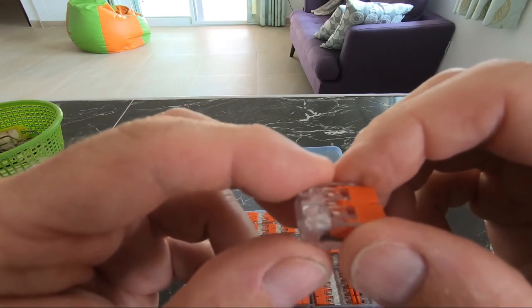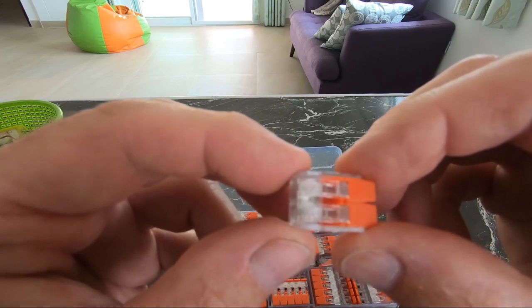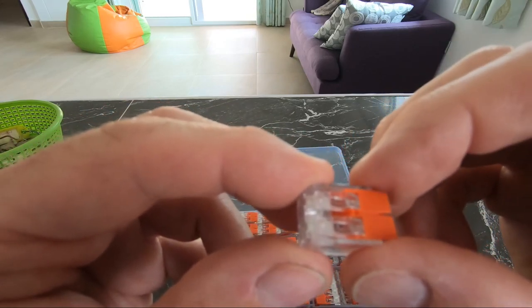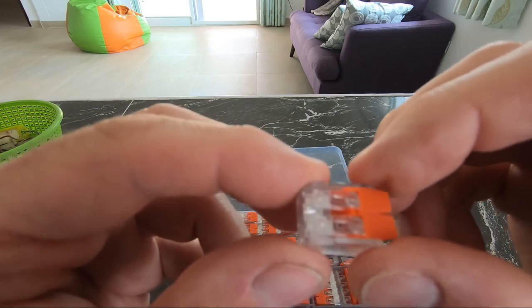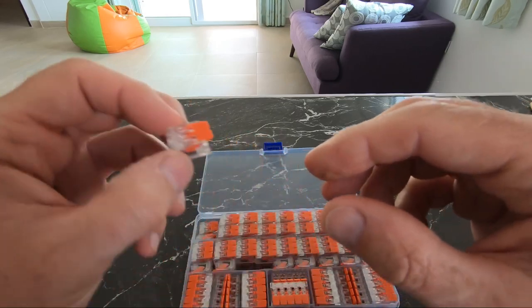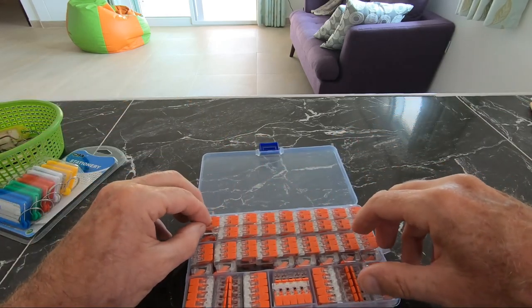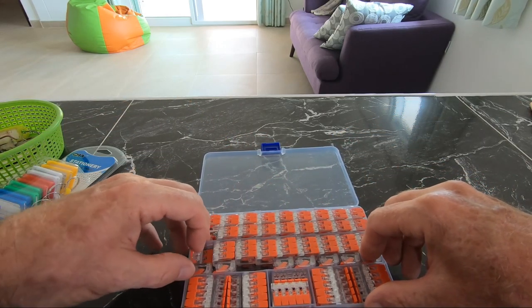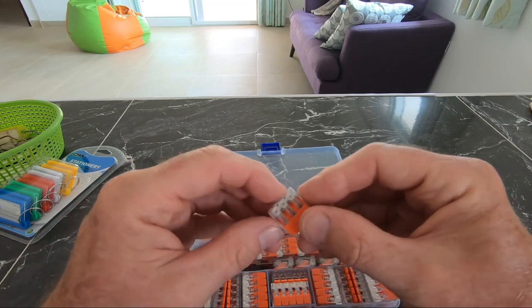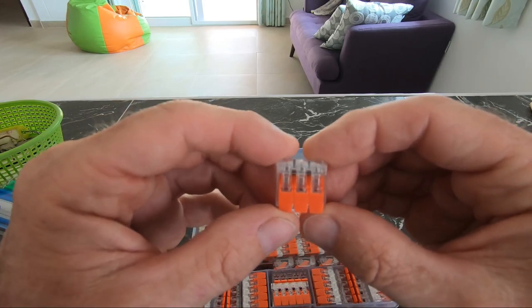And it's not going to unravel like the insulating tape that they often use here. That's what worries me about any connections anywhere here which are joined by insulating tape, is that one day the tape will dry out and the bare wires, the live wires, will be exposed and possibly could end up touching something.